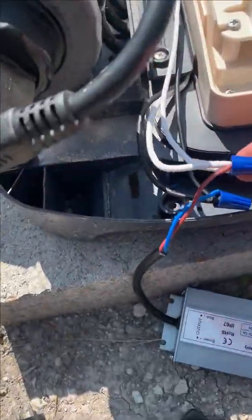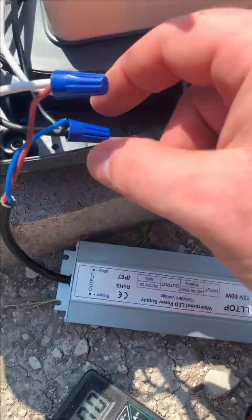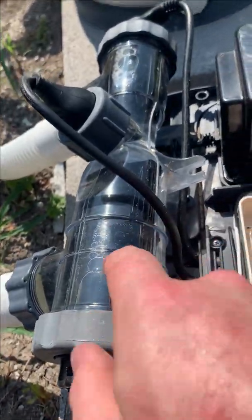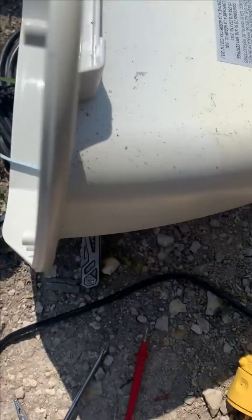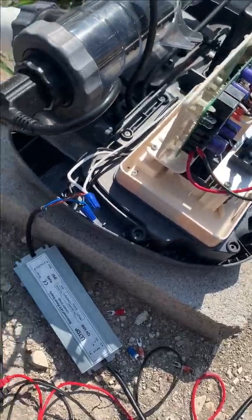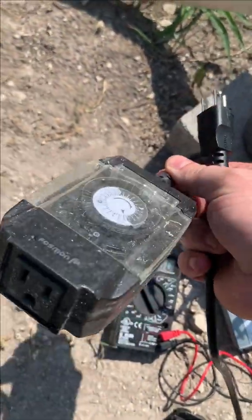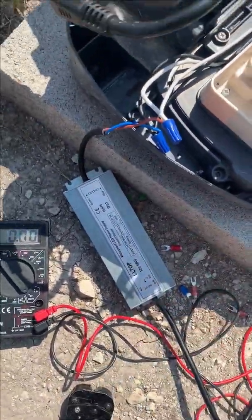Here's the fix. I put the white wires with the red wire that goes into the unit, and then the black wires with the blue wire. All it's doing is putting 12 volt through these cells and producing chlorine. Of course, you're going to lose your salt level sensors, which is the problem with this unit anyway. But I got an outdoor timer I'll be plugging it into — it's waterproof. This unit claims to be waterproof, but I'm still going to find a good spot for it.